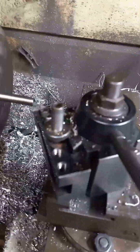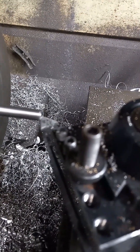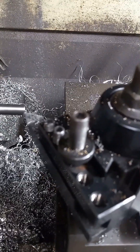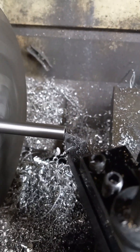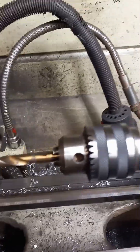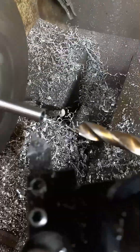So this one I'm just about there — a little bit more, just a little bit. There you go. Then I bring this guy in and it just gets rid of the burr on the inside. There you go. Then I grab my file and just hit the edge there and get rid of that.